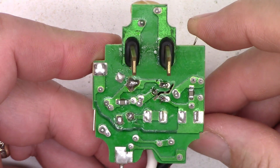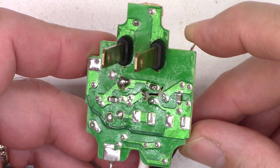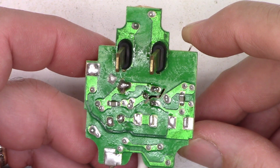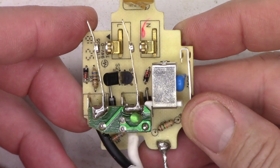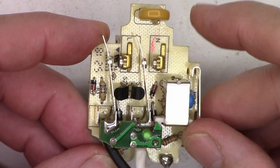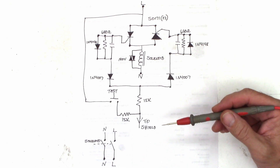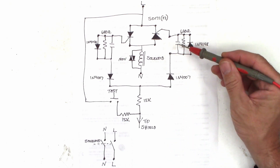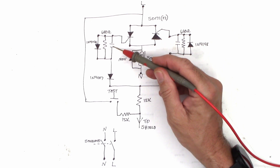Here is a close-up of the circuit board. There are absolutely no current transformers on this device, so it does not monitor the current leaving versus the current returning like a GFI would do. Let me go ahead and work up a quick schematic on this unit. You can see it's labeled neutral on this side and live on this side. Here is a schematic of the inside of this unit — I drew it out based on a quick reverse engineer. I did not remove the surface mount capacitors to measure their value, but I'm sure they're in the 1000 picofarad to 0.01 microfarad range.